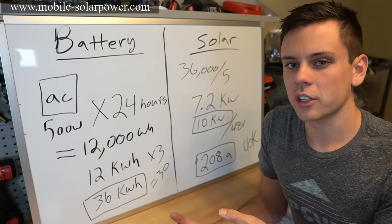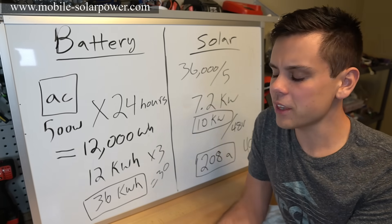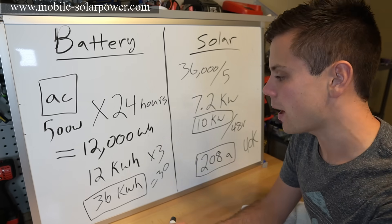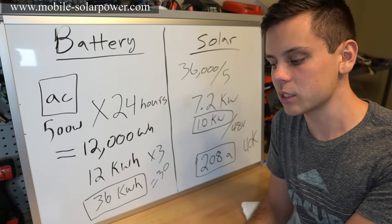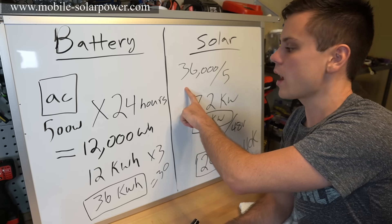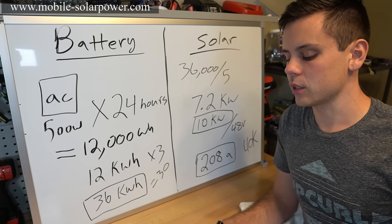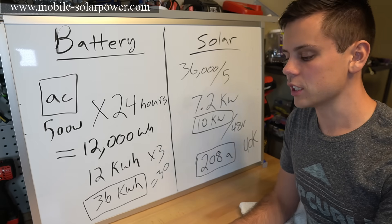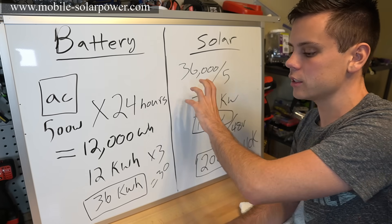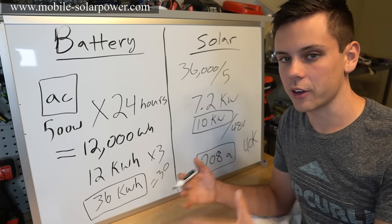In my personal experience after 10 years off-grid, 5,000 watt-hours has been great — it can easily supply a normal person's daily electrical needs. Over-paneling is also fun to do, but if you live far from the equator you'll need a larger array. Be careful though: in cold mornings, increased voltage output from the panels can cause voltage spikes that burn out the solar charge controller.